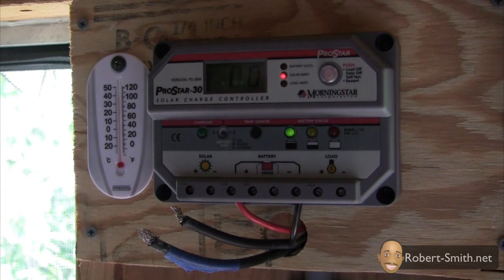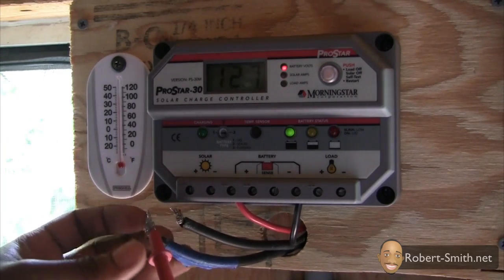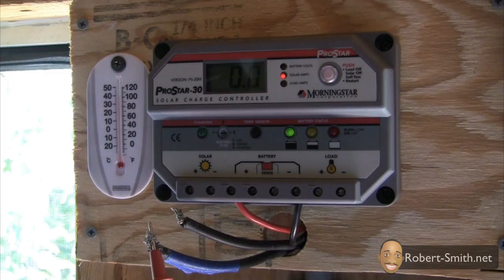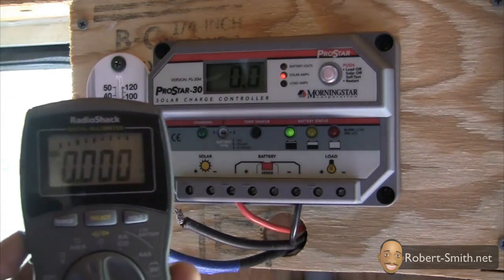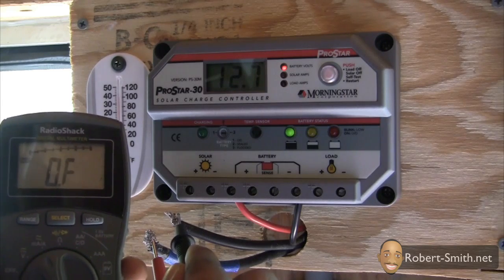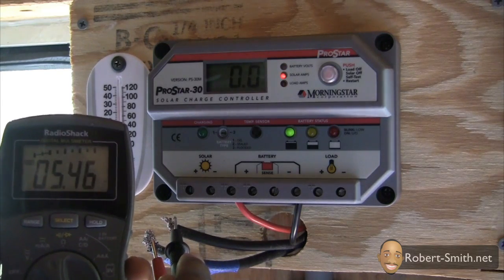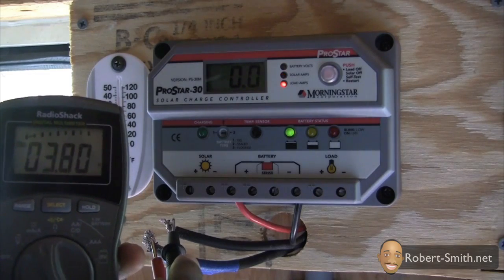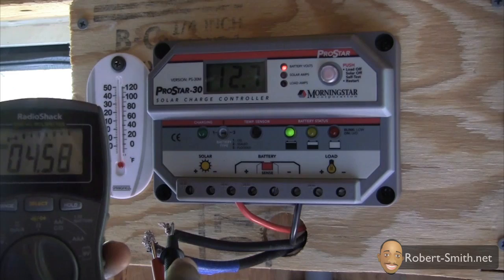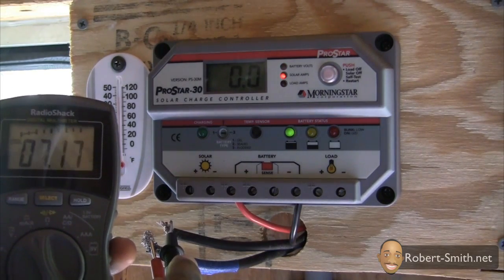What I have here are just my solar connections, which I already pulled out to make this a little easier for filming. I'm going to go ahead and stick one connection from my multimeter to the positive side and here's the negative side. Now I'll bring up my multimeter so you can see it and let's just see how many amps I'm getting. What I found from doing this test so far is that this multimeter can only read up to 10 amps.